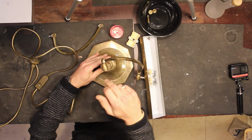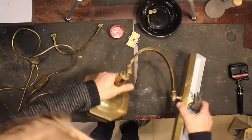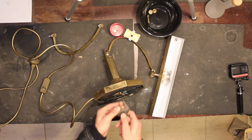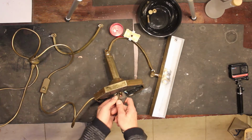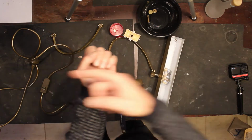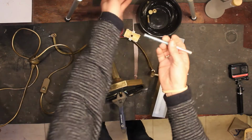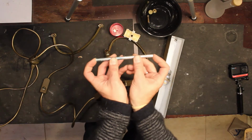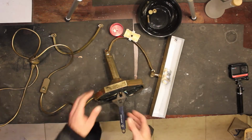So that'll be, I think this is a post-tension stand. If you're wondering what post-tensioning is, it's a technique of providing rigidity to a structure through tension on the structure. So only like an internal tension. So you get some tubes, put a chain, bar, or a wire down them, and if you tighten a series of tubes, say the same size, say this is broken, it would be all loose, and you have the wire going through it, and if you tighten it, it'll bring them all together and make it into a rigid piece. It's a basic theory.